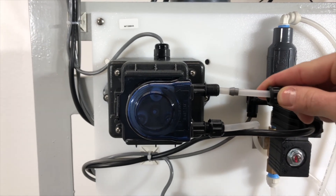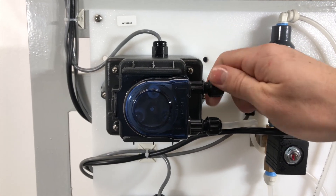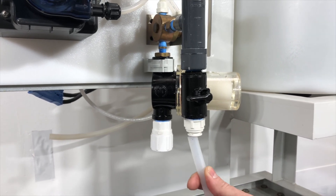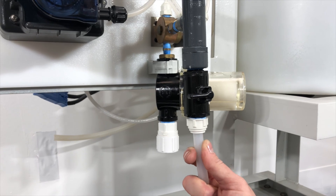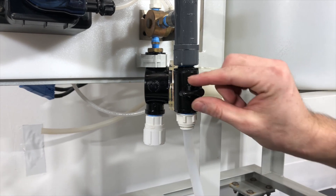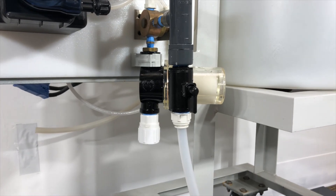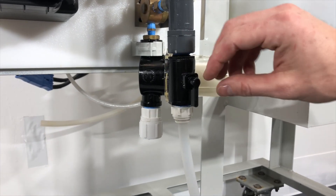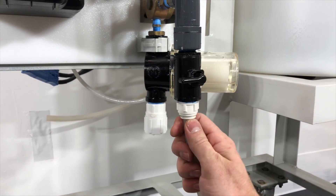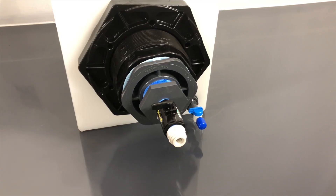Be sure to check the orientation of the rubber ferrule. Next, connect the water line to the salt tank by inserting one end of the half-inch tubing as shown. Push the tube firmly to seat the connection. Open the valve by turning the handle parallel to the line. To remove the tube, close the valve by turning the handle 90 degrees to the line, push the valve ring up, and pull the line out. Leave the valve in the open position and the tube inserted.